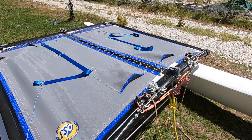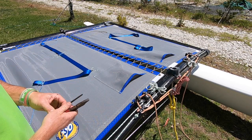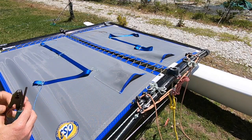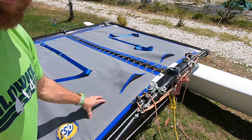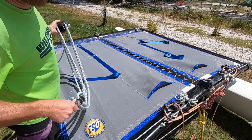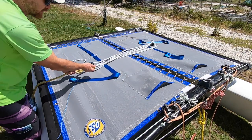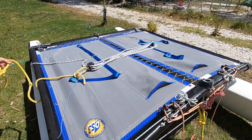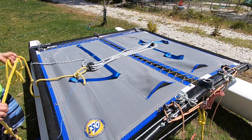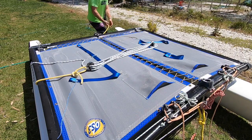On the 16, tightening the middle — the person tightening it is going to have to go underneath the boat to get the purchase, and the second person can be on top as the nipper. One thing that is very important when tightening a trampoline is that you don't put any weight on the trampoline while you're tightening it, because that will stop you from getting it as tight. One trick to get your trampoline a bit tighter on a 16 or 14 is to use the main sheet blocks — tie the capsize righting line on and pass that around the beams halfway.